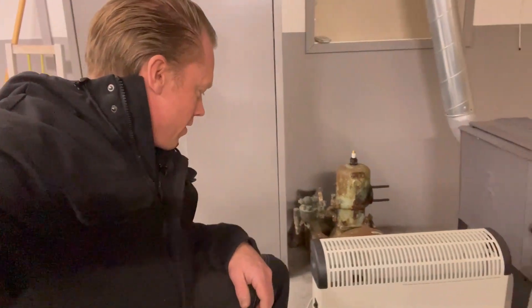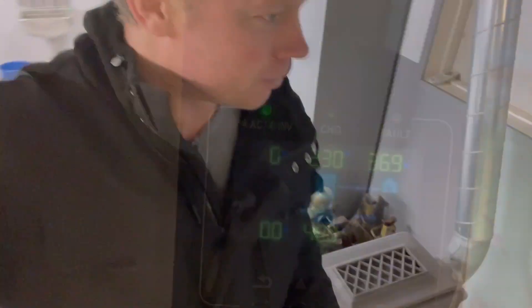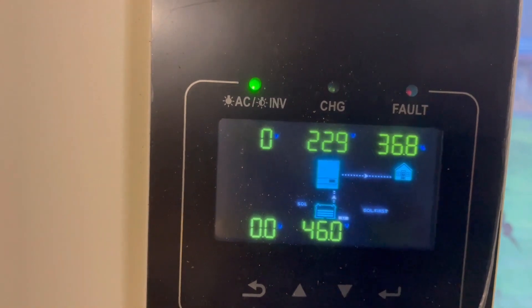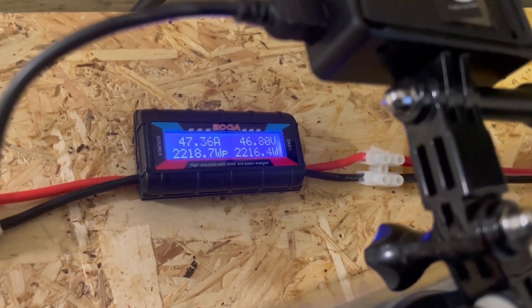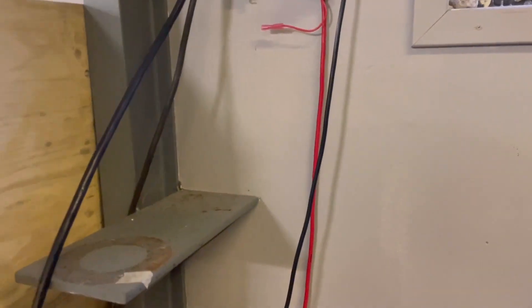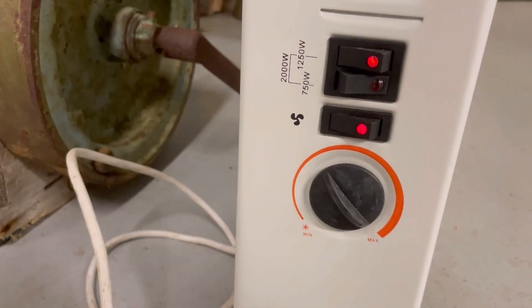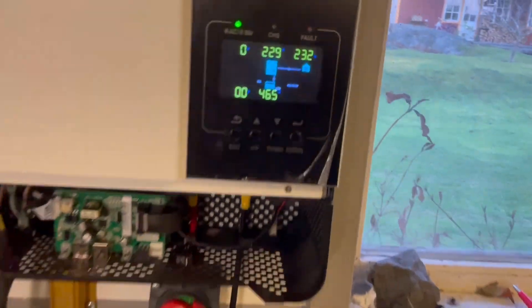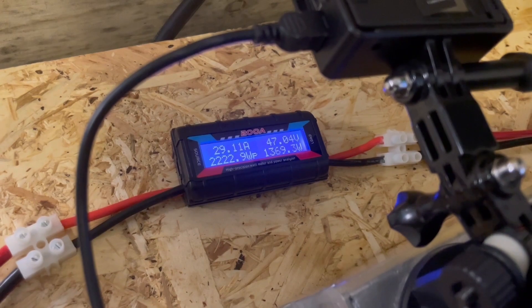We have to test this on max power. We are up to 36.8 percent load on the inverter, pulling 47 amps out of this module at 2200 watts. The cables are getting hot, so I'm going to switch it back to 1200 watts. Okay, that's a little better — back at 23 percent and down to 29 amps. I just had to test it.